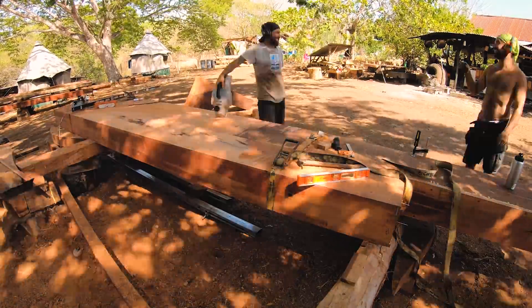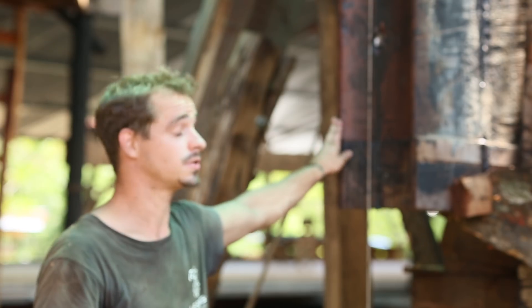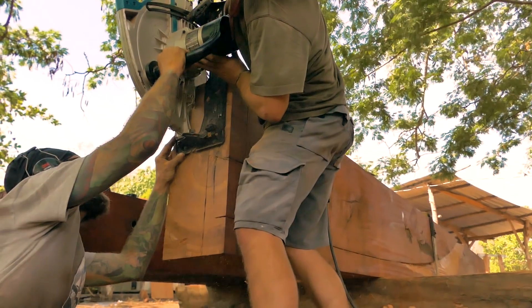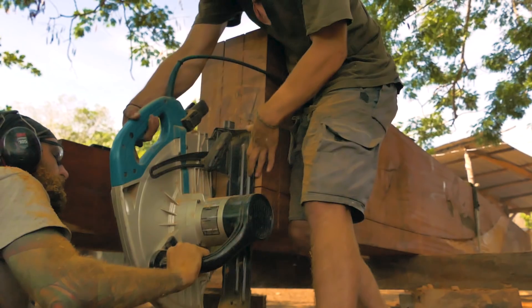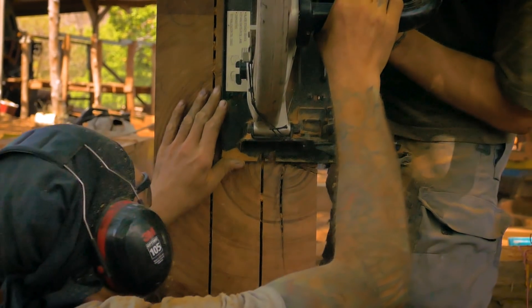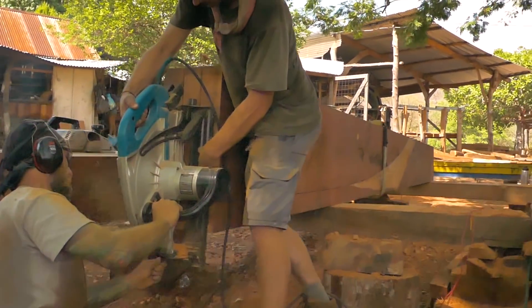The very last phase of the ship on this side of the rudder post — we had to make a groove for the rudder itself, because the rudder would be like a round-shaped shaft. So we had to make this rebate at the back of the rudder post. We call that the rudder gutter.